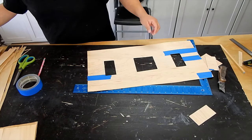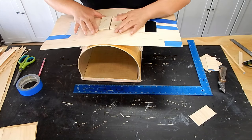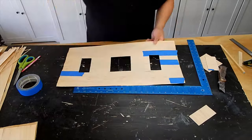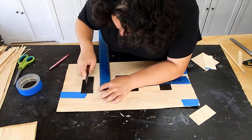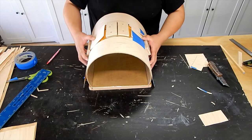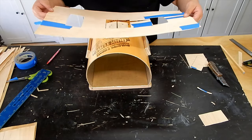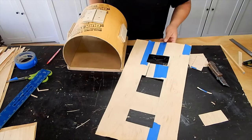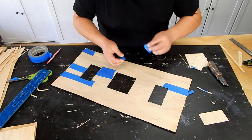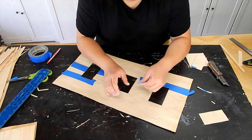That's what you've got to be careful of — follow the grain. I'm going to undercut for those two side ones just to make sure everything is working properly before I plow through everything. I might want to open these up just a bit, and I'm going to have to take a little bit off the inside of these. I'm going to measure out and cut the other four — it should not be nearly as difficult since I'll now use this top one as a template. This one is going to end up stuck somewhere in the middle because there are far too many breakages, but we'll just hide all the blue tape within the inside of the bend and you won't actually see it.